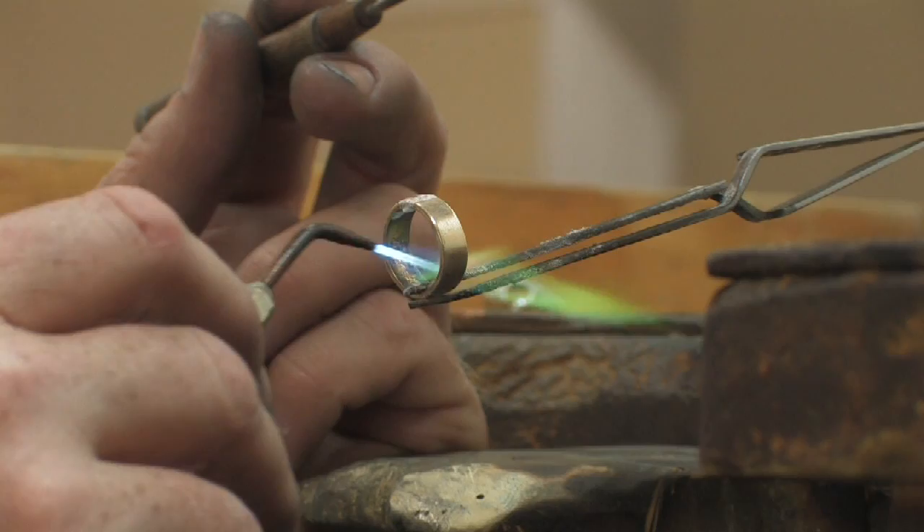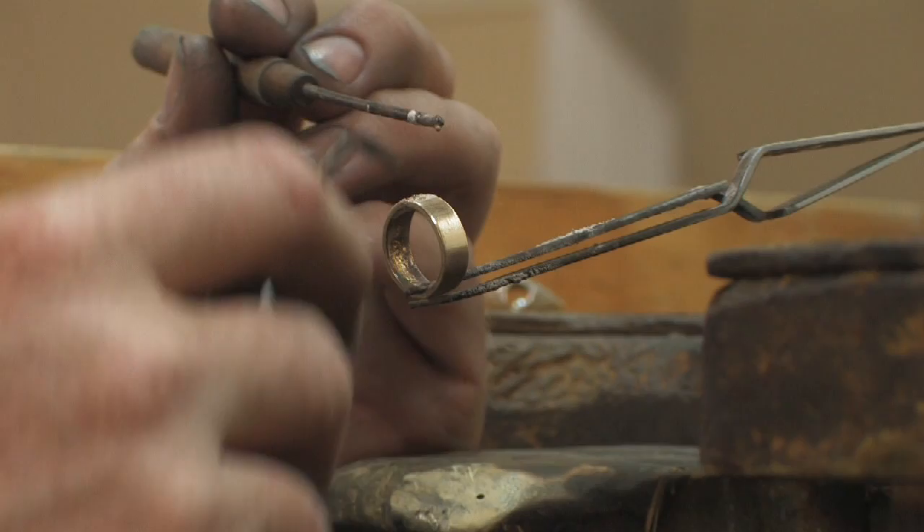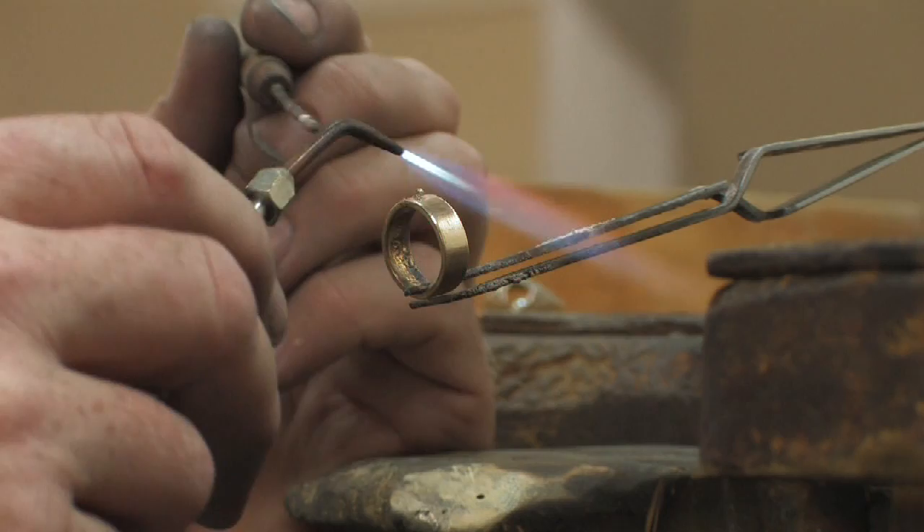So what I'm going to do is I'm going to come down here and I'm going to heat the bottom of this up. And you can see my flux starting to bubble up on the top here. So once all of this is hot, now I'm going to be able to control what I'm doing up here. So I'm going to put my solder on here.